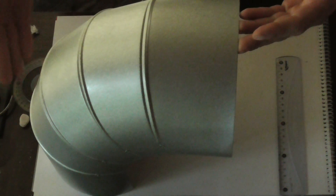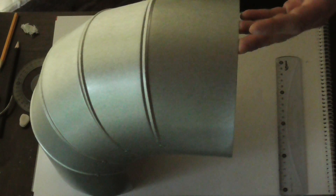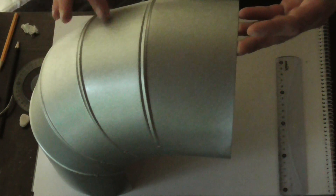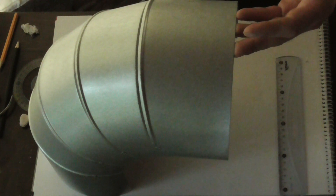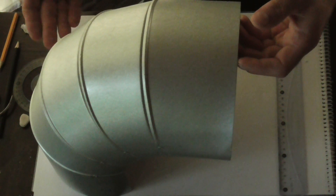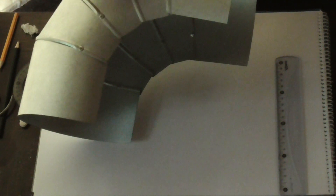This is it. It's a 60mm fitting and it's got 25mm of insulation on the pipe. It's got a starter, three segments and a finisher. It's known as a two and three pattern. It's held together by a male and female swage, which in this case is number two, and we're fastened with rivets on either side like this.